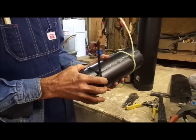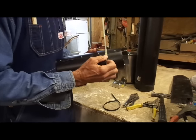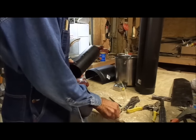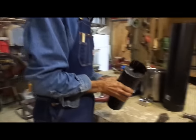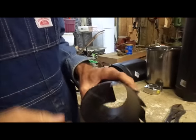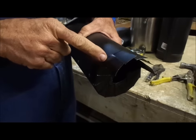When I get through, I slide the zip ties off, because the pipe will hold itself at that point, and I take the zip ties and hang them back up in the shop for my next rocket stove. Once I've done that, you'll notice at the bottom of this pipe — I measure up an inch and a half and draw a line around the bottom of the pipe.